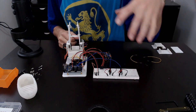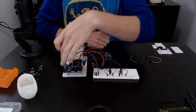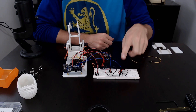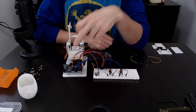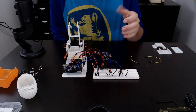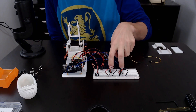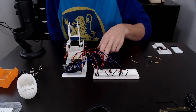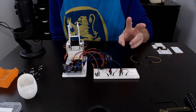This big mess here is our wiring. The Arduino — our microcontroller — can read the change in voltage when we turn these two potentiometers. We turn a potentiometer, the Arduino reads the change in voltage, and then through these yellow cables it tells our servo motors how much power and what direction to move based on input from the potentiometers. The power from the Arduino powers the potentiometers, the power from this battery pack here powers the servos, and everything shares the same ground — which is key when you are working with two power sources in one project.